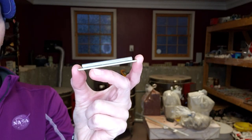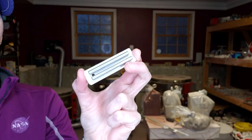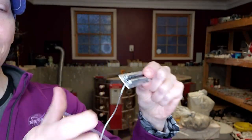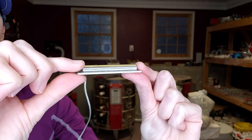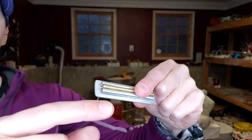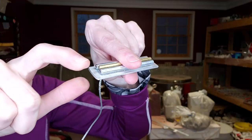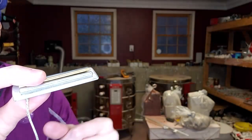From the side here, you can see the flat bar, and then I have two of the steel rods glued onto it with two-part epoxy. I drilled a hole in the flat bar. The rod piezo sits right down in between the two steel rods, with the wire coming through the hole in the plate. And then the brass rod sits on top of the piezo, just a little bit higher than the steel bars. So the strings run across the brass and transfer the vibrations onto the piezo, allowing you to amplify your guitar. In my applications, I leave this rod loose and the tension from the strings holds it in place, but you could glue some pieces here on the ends to hold it in place. And you can also file some grooves in your brass rod for your strings to ride across.